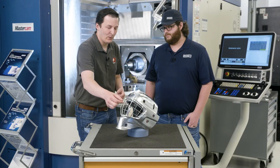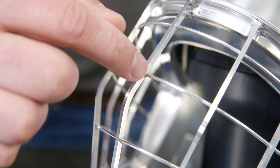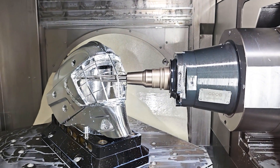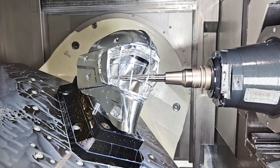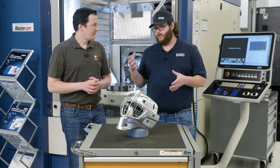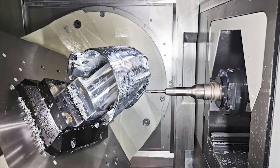What's most impressive to me is the fact that we were able to machine these sub-2mm diameter horizontal tubes nice and smooth. So much of this part was done multi-axis, and we can credit the Siemens control for that. The Cycle 832 on the machine enables us to really smooth out those toolpaths and create very fluid motion on the machine.